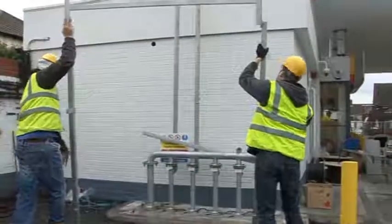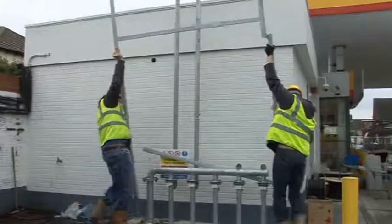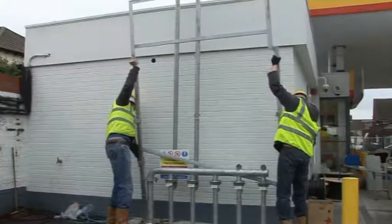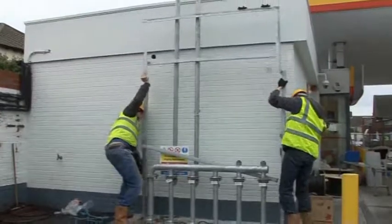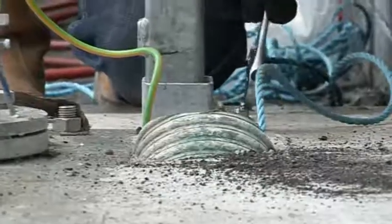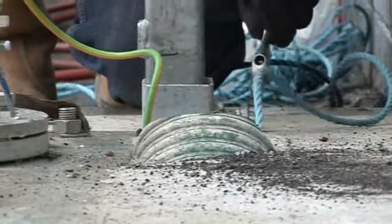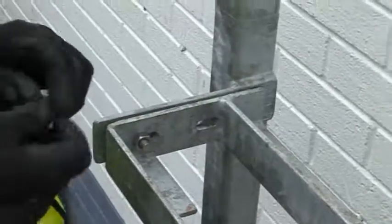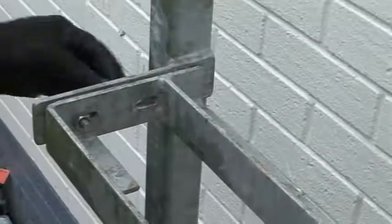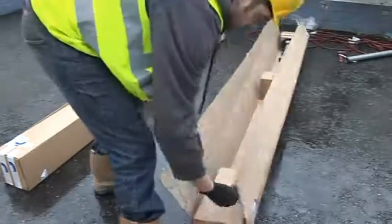Lift the uprights and Easy Riser bracket into the vertical position and then lower the bottom of the uprights into the upright support sections, ensuring that the uprights drop in as far as the unit will allow before tightening. Fit the cross member into position and bolt together loosely. Once the framework is in position, the Easy Riser can be installed.